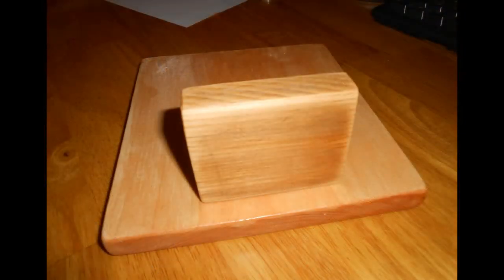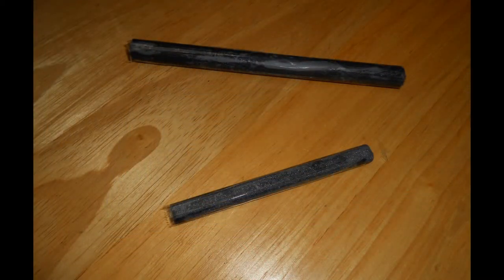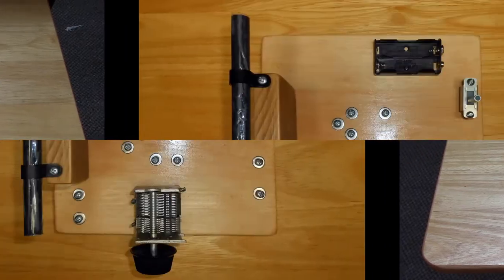The construction of the ferrite TRF amplifier is pretty straightforward — just typical wooden board construction, which I'm using in this series. Feel free to use something more sophisticated than this primitive method. I started out with a six-inch piece of ferrite and then tried a longer piece to see if I was getting more gain. We've got the ferrite rod suspended up in the air a little bit, because if it's sitting on a desk or object with metal in it, that's going to detune the ferrite rod.